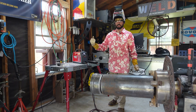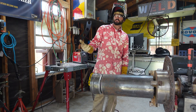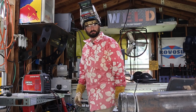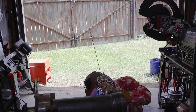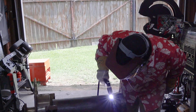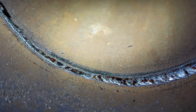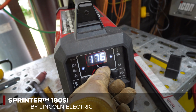5G's not too bad — it's the same weld. Just wish we had something to rest on on this side. Let's put a bead in a little faster without all those starts and stops and moving cameras. This side went a little bit easier. There's the bottom, the side. This bead is just facing us at this point. We're going to try to blend everything a little bit better on a hot pass. Let's hot pass it real quick.